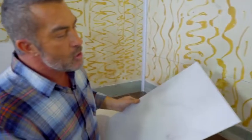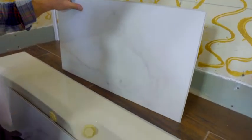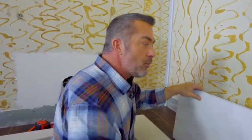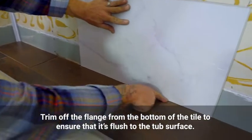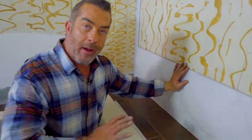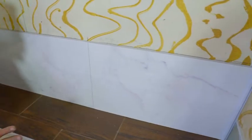Before we glue, it's important that we trim the flange off. There's a flange all the way around these tiles that makes a tongue and groove waterproof seal. For the first course of tiles, it's critical that this course is level because that's what we'll stack all the rest on top of. We'll trim off that flange so the tile sits flush right down on top of the deck. You may also need to trim the bottom DumaWall tiles to get a level top line. Now that I've got all the cuts done, I went ahead and dry fit this first before applying any adhesive — everything fits right and looks good. We can take this apart now and get ready to glue it on the wall.